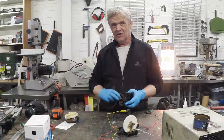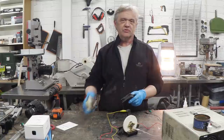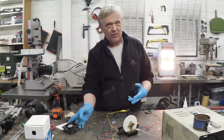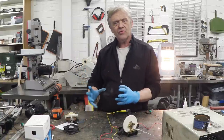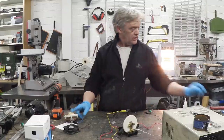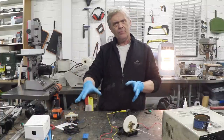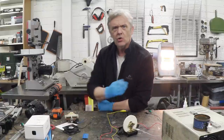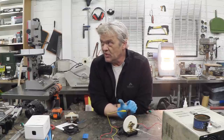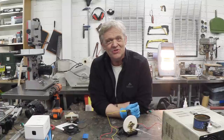You started finding them in things like washing machines, and then of course in electric vehicles. A washing machine probably draws a couple of hundred watts; an electric vehicle draws kilowatts of power. At that level, the silicon needed to cope with that kind of power is stupidly expensive. If I want an electronic speed controller for something small it might be two or three pounds, and that will last forever — but the minute I start going into real power you start paying stupid money. The controller for that Twizy is a Sevcon; they start around £400 and can go up to over a thousand pounds.